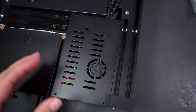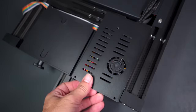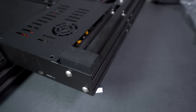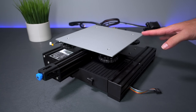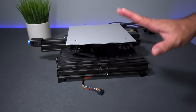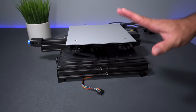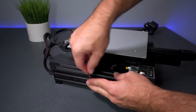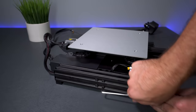Adding any kind of mods might be a little bit hard since it's tight in there. I also wanted to mention these feet - very nice, and it's good to see them here on the Ender 3. Before we continue with the build, we need to check a few things. Make sure the frame is sitting level so it doesn't wobble side to side. Check all the bolts and make sure they're tight because over time they do loosen quite a bit - this one was very loose, and same on this side. We found quite a few loose bolts and we want to tighten everything up because the more solid the printer, the fewer problems we'll have.